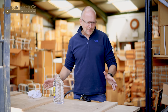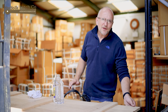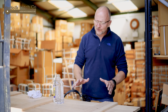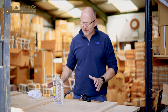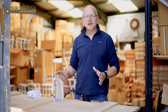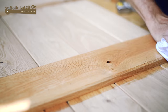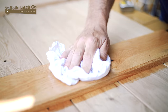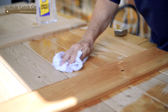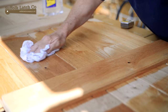The door's now out of the packaging, it's been inspected, and I've gone around and sanded all the edges so they're now softer and won't actually damage yourself. I've found any problems on there, sanded out the worst of it, and the final stage now prior to the oiling is to give it a good clean. This clean gets rid of the dust — I've just got a straightforward, very cheap white spirit here. I'm going to go around the entire door, give it a good rub down, remove the excess tannin out of the wood, get rid of any dirty marks and leave it with a great base.